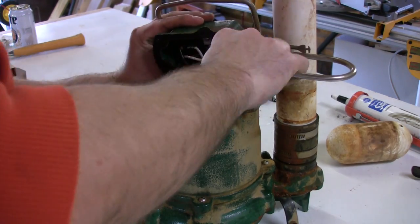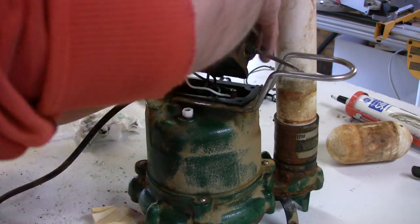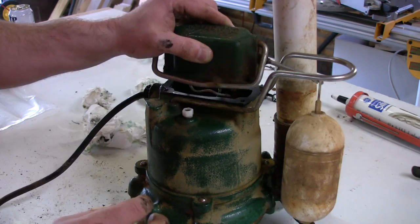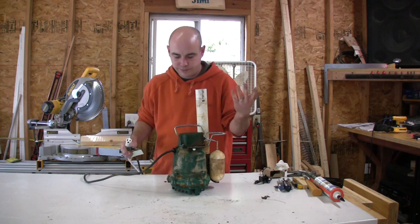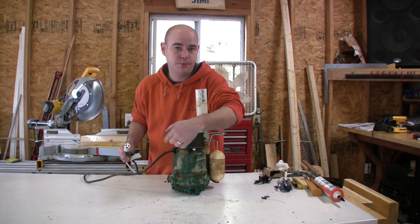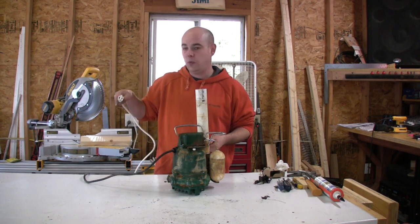Really this is only about a 30-minute job — I'm pretty sure anyone could do this. I'll put a link in the description for the switch that I used. This pump's been running now for three weeks and it's working flawlessly. I used silicone — you really don't have to, but I felt like I needed to put some on. Definitely going to let this dry for at least three hours before I put it back into the sump well.